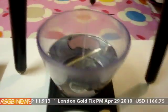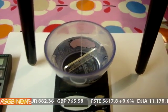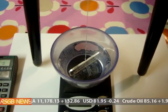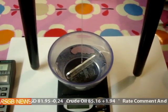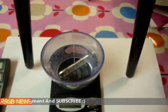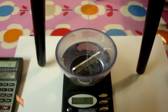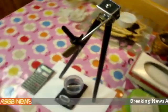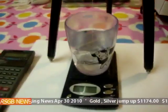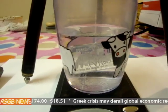So this is the divisible bar. What we're going to do — because I was going to cut this one up, and people suggested maybe a tile cutter, which I thought was a brilliant idea — but because I'm going to chop this up, I thought we'd do some tests with it first. So we're going to measure the specific gravity, and I'll show you how to do that. This is my makeshift setup: my camera tripod, then scales, and the silver is literally hanging in the water.